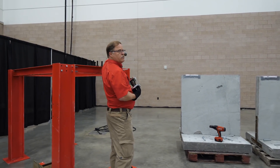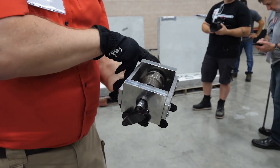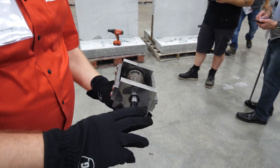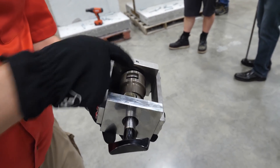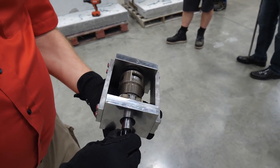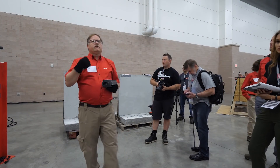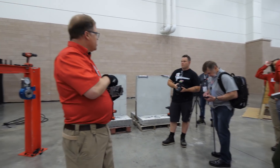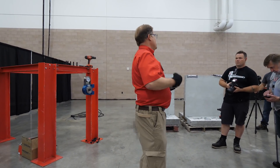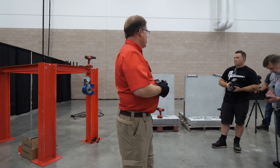The motor is in the front of the back of the tool. Up here is a transmission, and this is a model of what that looks like. You've got the anvil in the front, and it actually has another part we call an anvil in the back. As I turn this slowly, there's a single hammer on the inside that spins, engages the spring, and picks up a second hammer that brings that mass into impacting. What that does is give us a longer lifetime tool. Using the motor to drive the small hammer and the spring to pick up the second hammer means I'm not stressing that motor as much and not drawing as much energy out of the battery — that gives us a longer lasting product and gives your customer more work per charge.